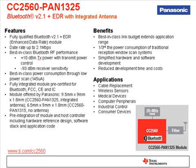When doing this, you have to open up a reception window on each of those 79 channels. This consumes full active power. You have to do one channel at a time. It can be time consuming, but also very power hungry.